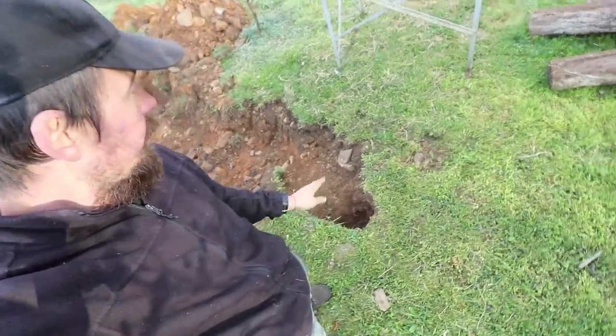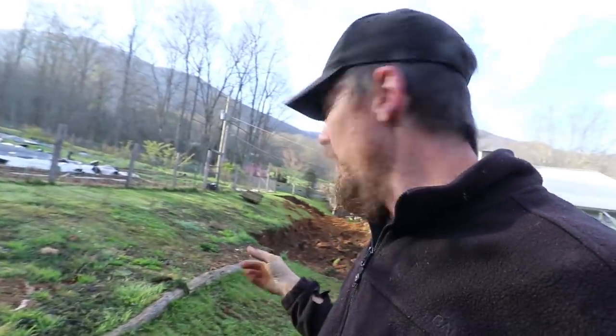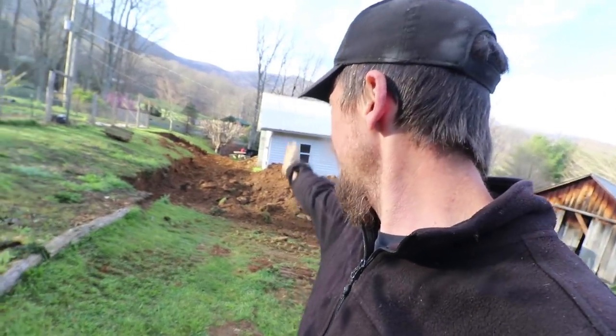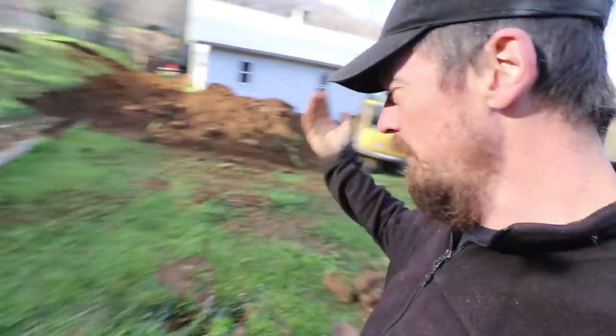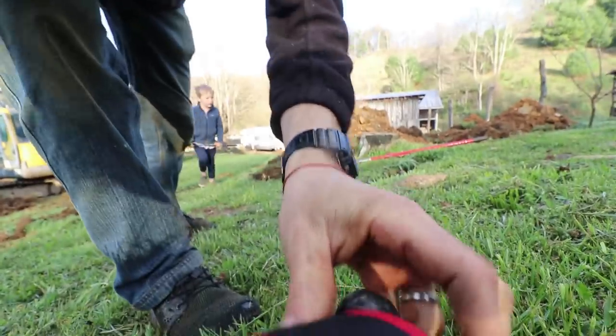We're rerouting this water from here down there, and we'll put cutoffs here, but before too long he's gonna get into the water pipe that goes to our house. It's switched off over there, but this line that runs under here is live with water, so I'm gonna try to put in a temporary cutoff right here just so we can keep rolling with moving dirt while he's got time. First we gotta dig the line up though.